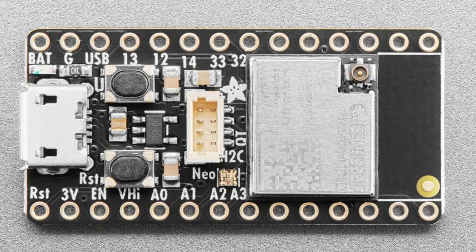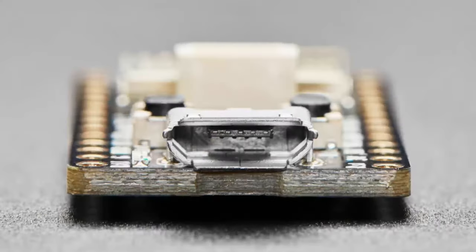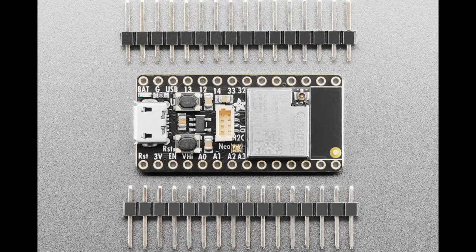We support it in CircuitPython, it has great Arduino and MicroPython support, and the ESP32 is a very standardized chip. What's really nice about this board is its very good low-power capability — I tested 10 microamps in deep sleep before the show, which is incredibly low, as low as the ESP32 can get. By using a good regulator, you can use this for very low-power IoT projects. There's also one pin shifted up to five volts, great for NeoPixel projects.